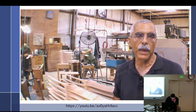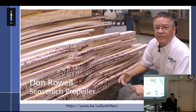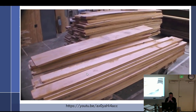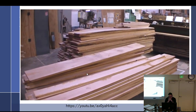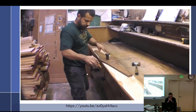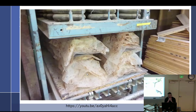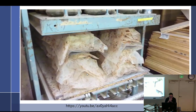All of our blanks are manufactured from laminated birch. They can have any number of different laminations — from four up to six or eight depending on the propeller design. The wood is selected based on color, grain, and the lack of knots. Then the patterns are laid up and marked off based on different prop designs. Once the boards are selected they are planed down to finish thickness and laminated using resorcinol glue. After a seven to ten day cure they are sent to the CNC area.